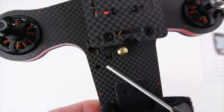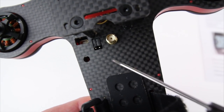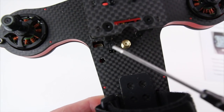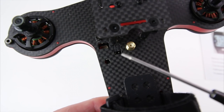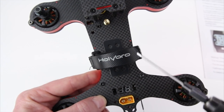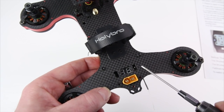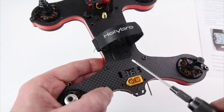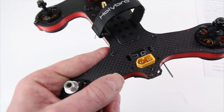Further up the frame is the VTX power switcher — it switches from 25mW up to 600mW. Move the two little dongles to the furthest point from the back of the quad to get 600 milliwatts for more range. If flying with other people, back it down to 25mW. There's also UART1 and a bind button here. Underneath the frame there's a hookup for Spektrum on UART3, and right next to that is the S.Bus and PPM connection. By the way, it does work with Fat Shark goggles — it ships defaulted to 5740 MHz, which corresponds to channel one on Fat Shark goggles.